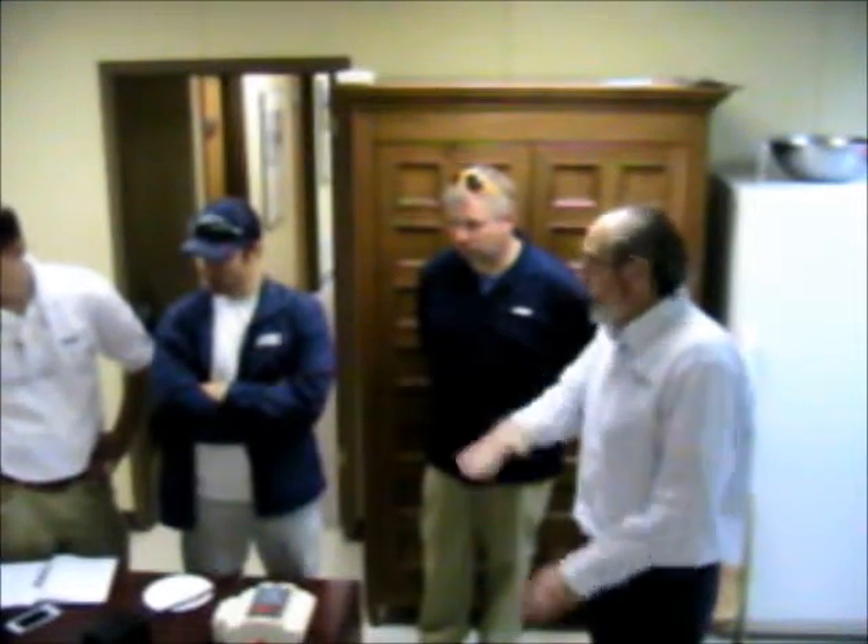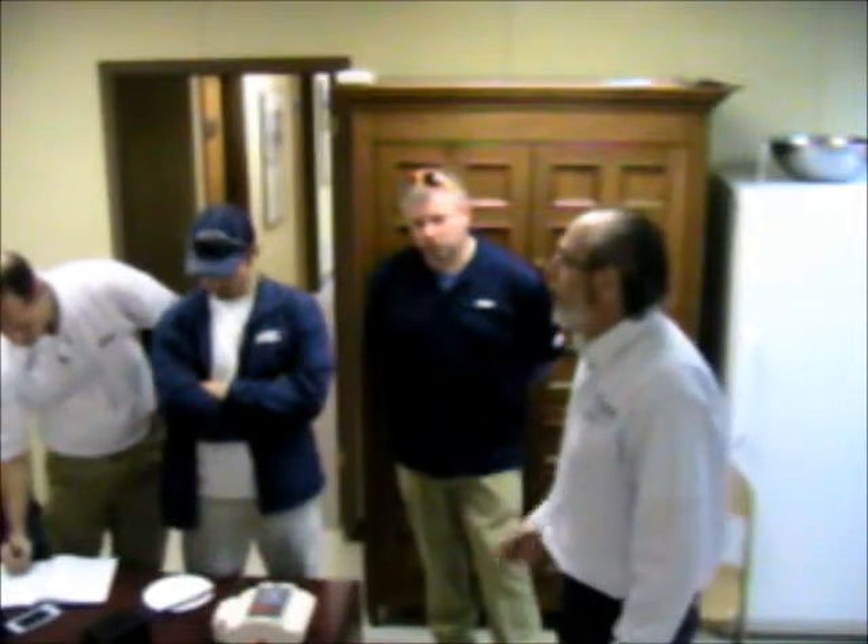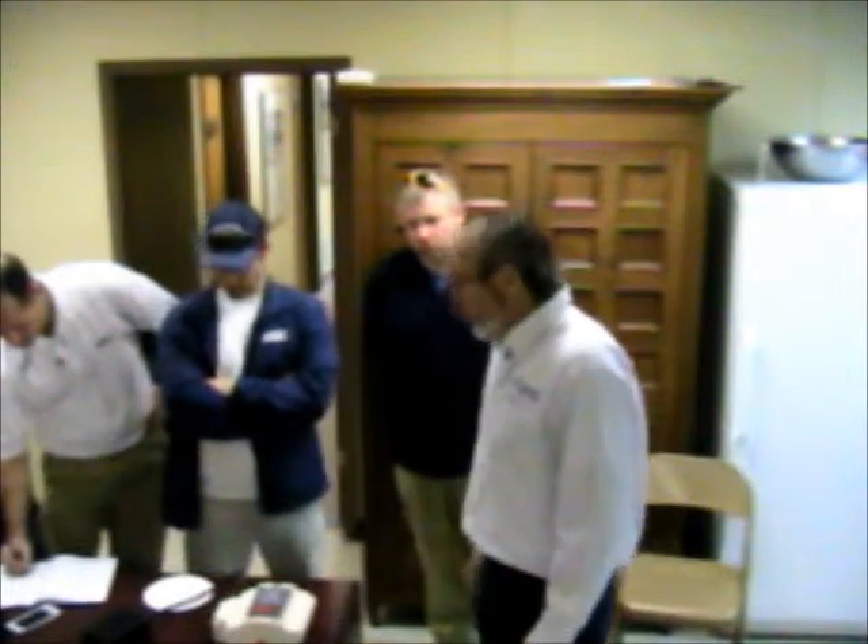If it's set for 11 minutes and it primes in two, it overrides that. When you're running it, if you look on the screen it'll say 'priming.' As soon as it really primes, even if it's a minute, it'll pop and say 'running schedule five' or 'running speed three' or whatever it is. If you hit the down arrow once you'll see prime sensitivity.